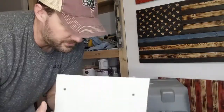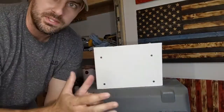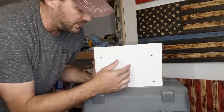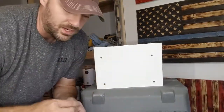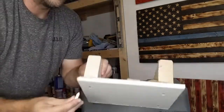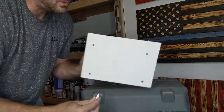What I've found is difficult when hanging things into studs is if you're going to a wall and you want it to be centered, usually there's not a stud that is directly in the center of that wall. So you often have to drill in and use big anchors for stuff into the drywall. But these are rated for a lot of weight. These will not go into a stud. And so you have to find a hollow drywall in order to get these in.